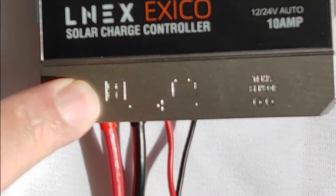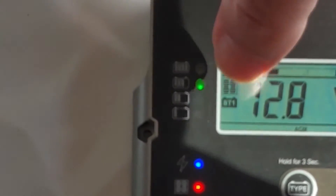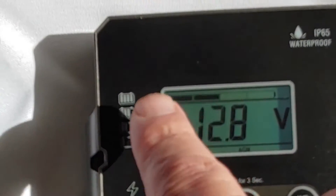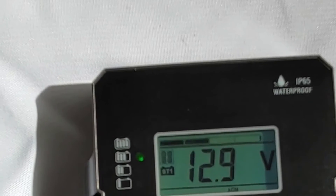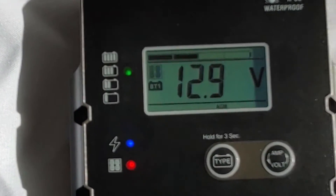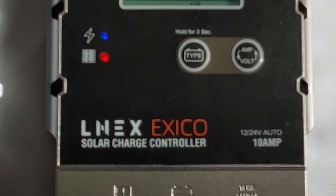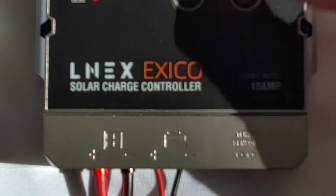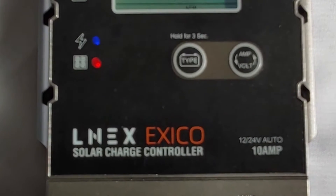The little solar panel right there — same thing, plus to minus. I've now hooked the solar panel up. It's going back through all of its setup because now it can sense the solar panel. You can see up here it has a picture of the solar panel and you can also see at the top where it's charging. You can also see this in amps or volts — there it says amps coming into the system and volts where the battery is. Down here is your temperature sensor if you want to use that. That's the basic setup.